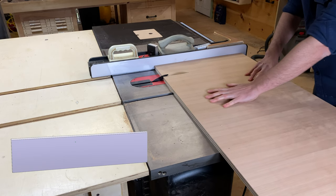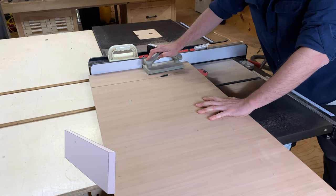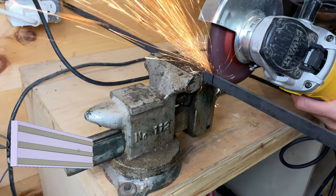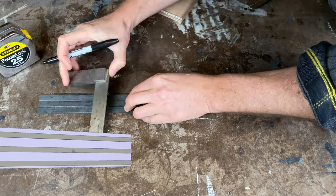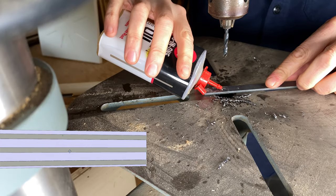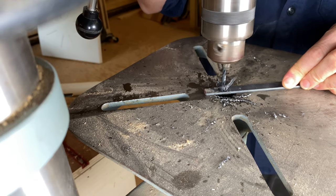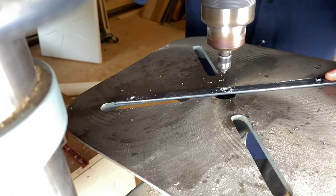The first thing I'm going to make is that blue panel, just by cutting out a rectangle of plywood. Then I'm going to take some steel bar stock — half inch by an eighth of an inch — and cut out three pieces the same length as that rectangle. The reason I'm using steel is because when the load cells are getting pushed against, I don't want them pushing up against plywood, which they'd dent into. Steel is less deformable, so when steel presses on steel, you don't get any unwanted movement.